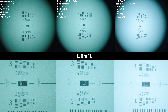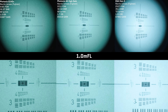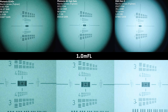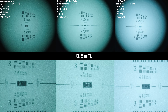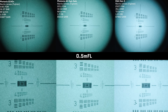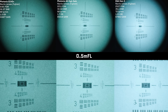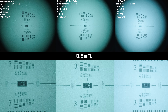Next is the resolution test on the Hoffman. This test lets us see pure tube performance with the light controlled in a very fixed way, removing all outside variables. One thing to notice off the bat is the Elbit tube appears a lot brighter, creating a more washed-out image. We had the option of changing camera settings to expose properly for the brighter parts, but we wanted to keep it the same to remove camera settings as a variable.